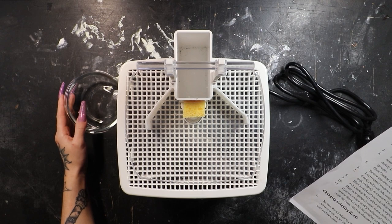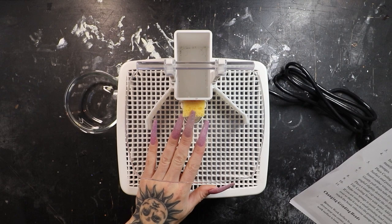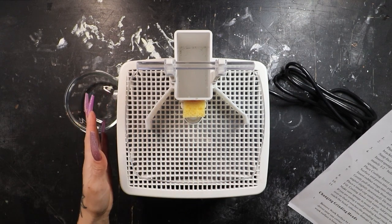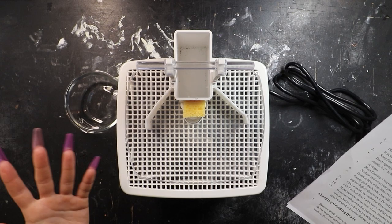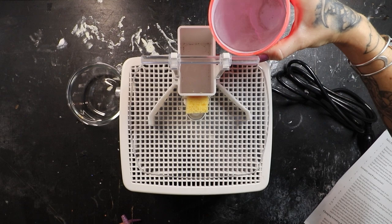It says to place a small cup underneath our drain hole over here to catch any drain water. Now we fill our cooling tower with water — add grinder coolant if you prefer. Make sure the sponge is wet. If you're using a small grinding head such as a grinding pin, you may fold the sponge over so it reaches the grinding surface. Always make sure that water can reach the head — otherwise damage to the diamond head may result. Let's fill up our little tower.